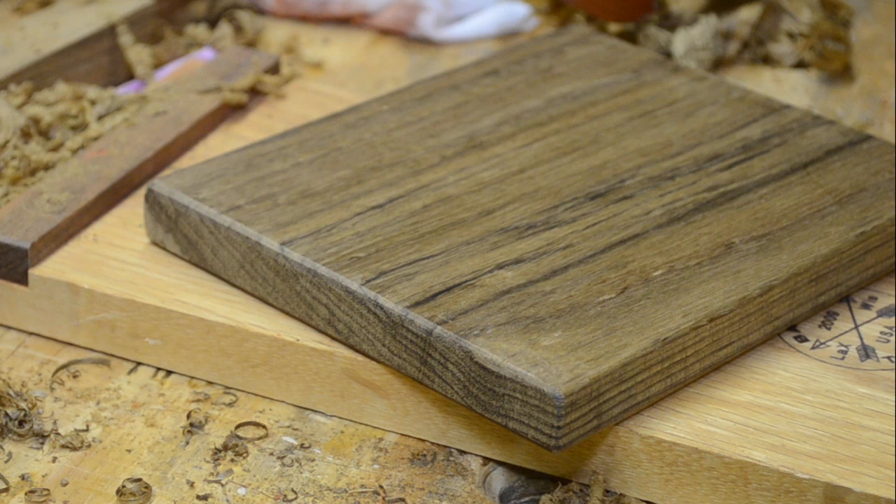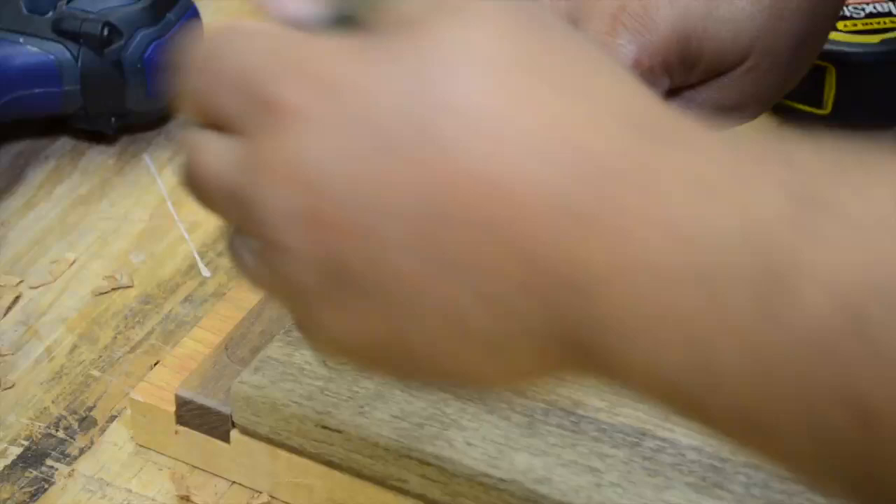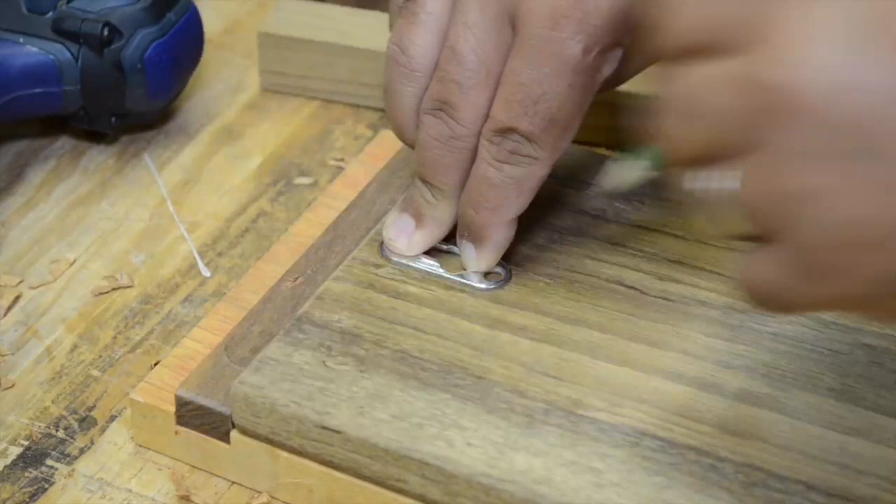Because these clipboards are meant to be displayed on a wall, possibly, I'll attach a keyhole clip to the back. But just in case somebody decides simply to lay them on a surface, we don't want them sitting up too proud or even potentially scratching the surface of a tabletop. So what we'll end up doing is recessing them below the face of the back of the board.